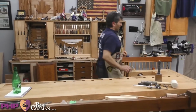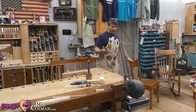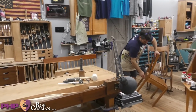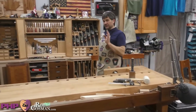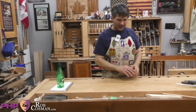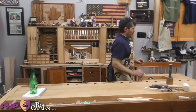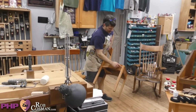I actually did another set of these for a guy who's now my accountant. I brought these through and wedged them. So these were through wedge tenons front and back. Way too much work. And it wasn't really a good choice because it further weakened the leg, actually cutting that mortise all the way through. Anytime you can leave a little extra material around the mortise, you're going to strengthen that particular member. So by putting a double mortise here, instead of one great big one.